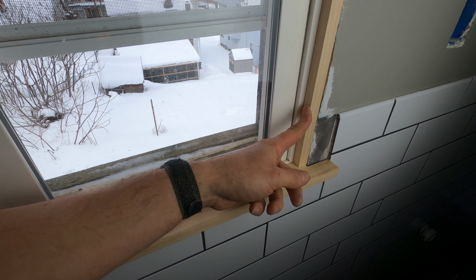To cover up the nail holes, I apply a little color match putty with the end of my finger and wipe away the excess. Finally, I mask off the window frame with painter's tape and apply a few coats of amber shellac for a glossy, easy to clean finish. While that's drying over there, I'm gonna get the trim put up around the doorway.